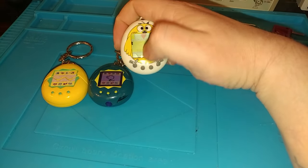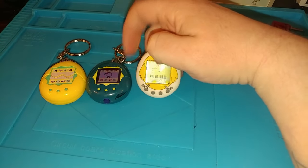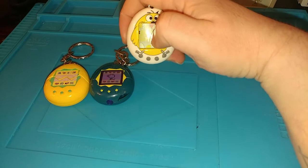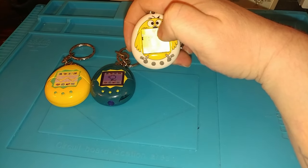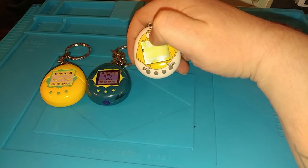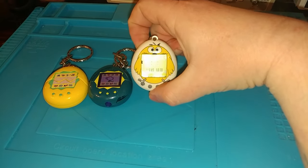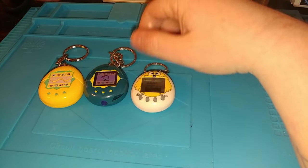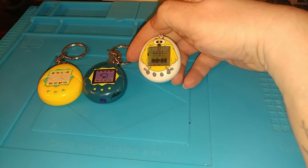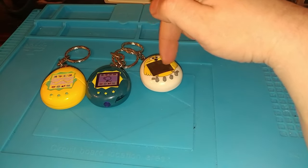And then concerning this, I couldn't find an LCD replacement. I did a lot of digging online and couldn't find anything. So I'll throw this out to the community that's currently following me. If you happen to know a proper replacement for this screen, you can link it or provide comments in the description. I would like to know. I think I found some modern LCD screens, but they don't have the same segment counts, nor the same termination points to the Zebra connector.